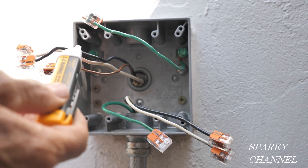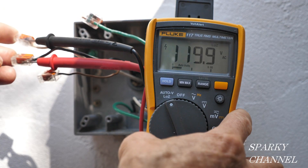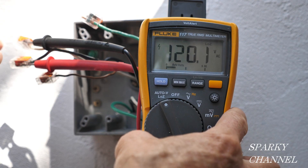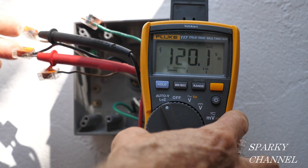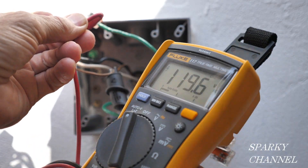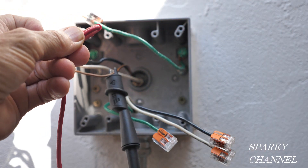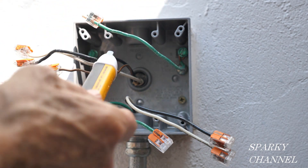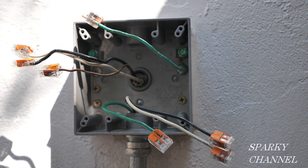There's only one hot wire — this one right here. This is my Fluke 117 electrician's meter. I have one lead plugged into this Wago lever nut and one lead into the other, and I have 119.9 volts AC — that's an excellent voltage. Testing across the ground wire I get 119.8 volts AC, so I have an excellent return path to ground. Good voltage, good ground — I know this is the line cable, so I'm going to turn off the circuit breaker.